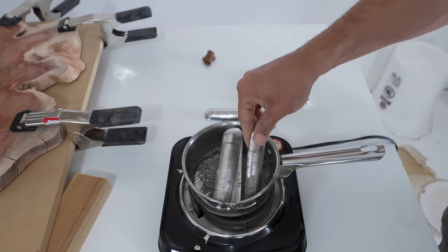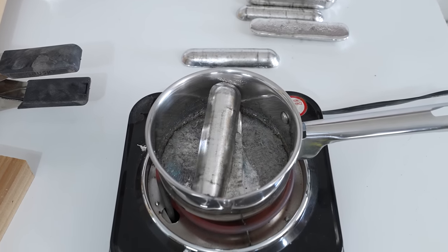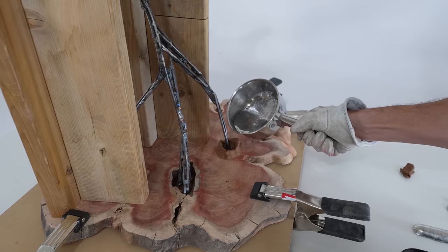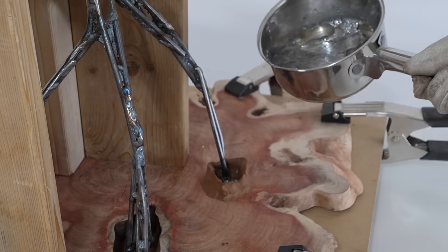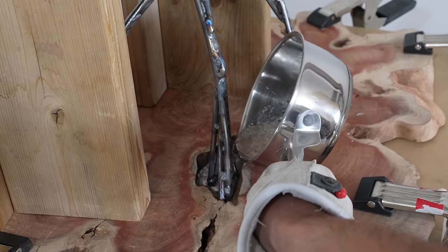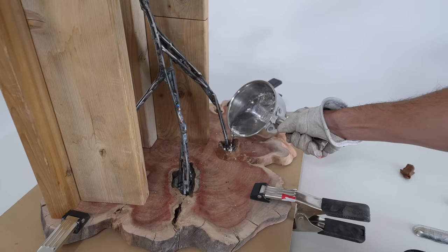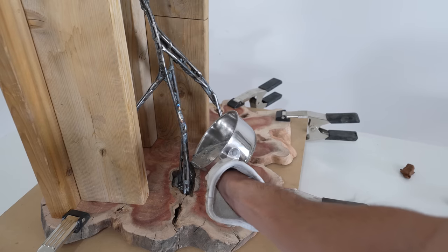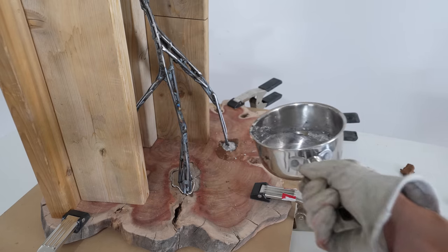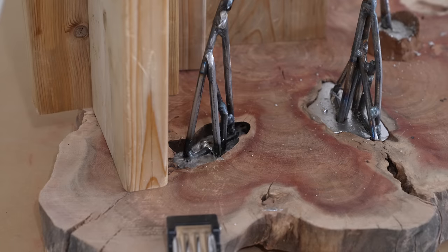I've found a few places to buy this tin and bismuth alloy and I'll link them in the description below. It melts at just about 280 degrees, and when I poured it in I quickly saw the mistake of using wet clay. The moisture in the clay reacted with the hot metal and created a bubbling, steaming effect, which led to the metal being a little more porous and grainy where it came in contact with the clay. That could be something you actually like for a rough texture, but wasn't what I was going for. So the clay sort of worked but had some unintended consequences in terms of texture.